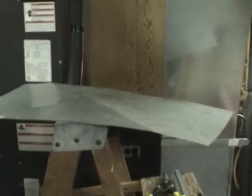Continue putting the rest of them on and then you just have to bend them over to cover up the edge and then put tape over it. We also have to cover up this hole. To patch the hole I cut this piece out of an old scrap of duct and we'll just screw it on up here. Here's the panel installed and the last cleat.